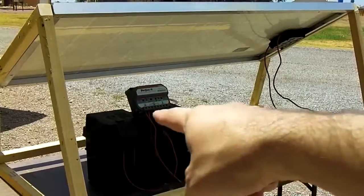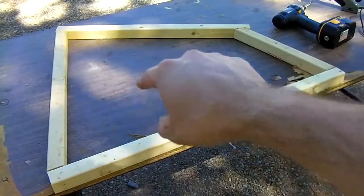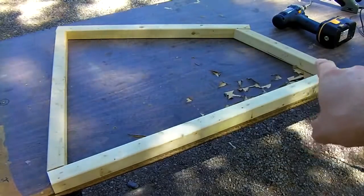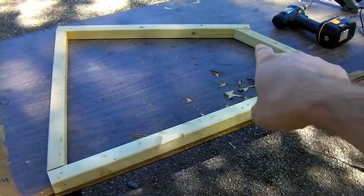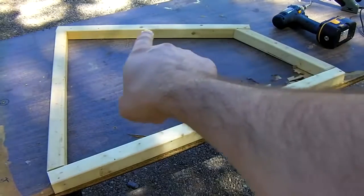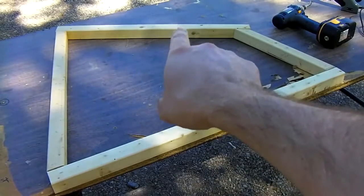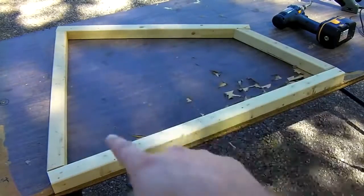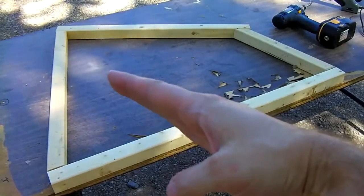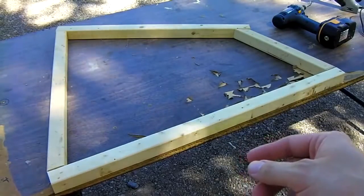The Walmart battery pack that I put together, angle here, 15-degree angle here, a 13.5-inch piece on the front, 15-degree angle cut, 45-degree angle cut here, and the top bar is 25.25. This is where the solar panel is going to be attached to. This specific setup puts the solar panel at a 30-degree tilt angle, which is a good compromise for pretty much anywhere in the northern hemisphere.